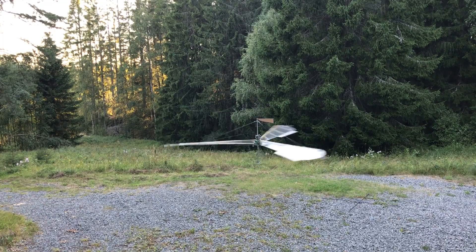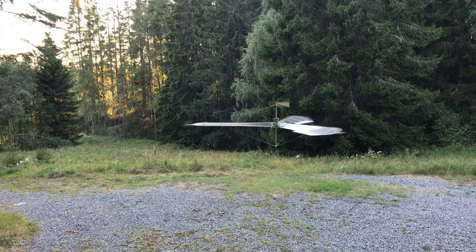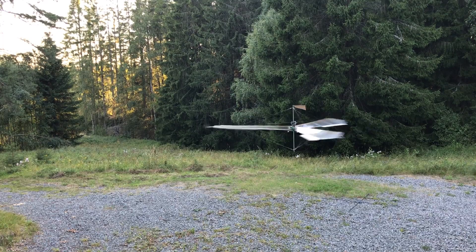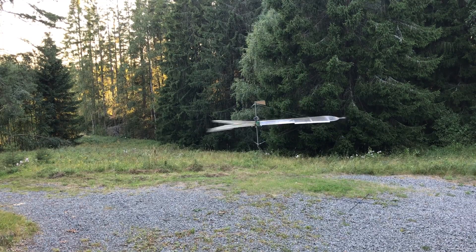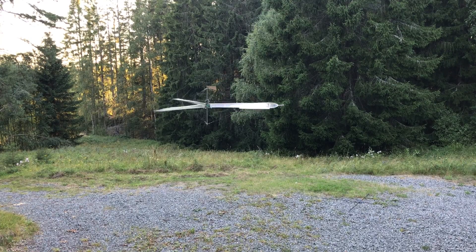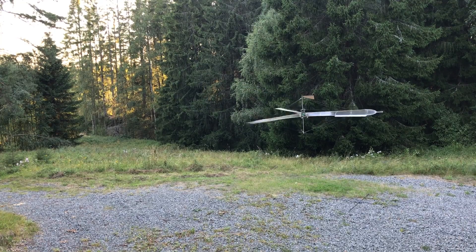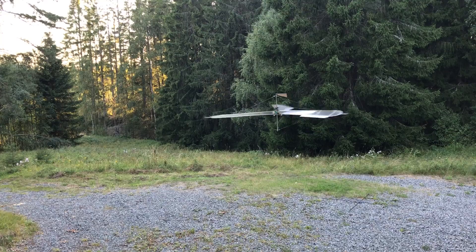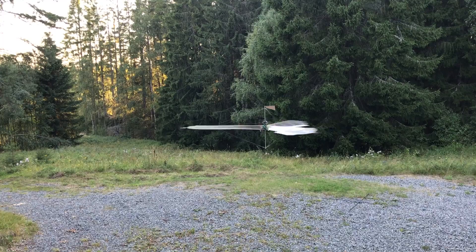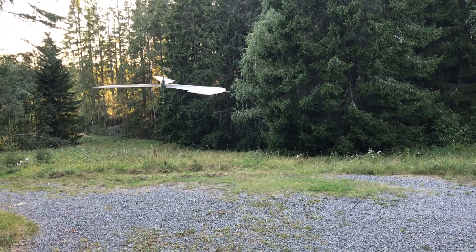Because I realized when I am going to set it down there is a pretty big risk that I will wreck one or several of the propulsion propellers. So I thought, let's just try to set it down without turning the power off and see if it can self-balance on the main tube there in the middle. And since that tube is actually not spinning — it is just the propeller with wires and a couple of bearings that are spinning — I thought that this would probably work. It won't drill itself into the ground anyway.